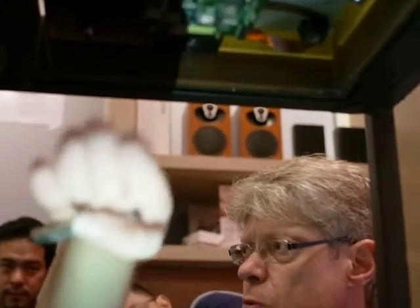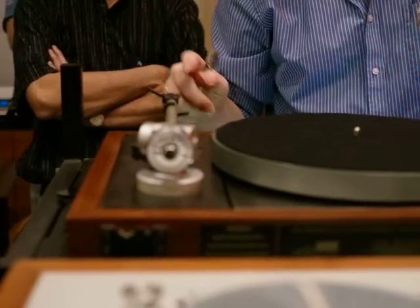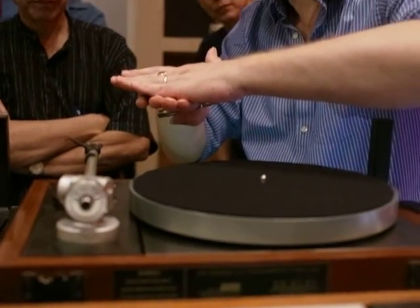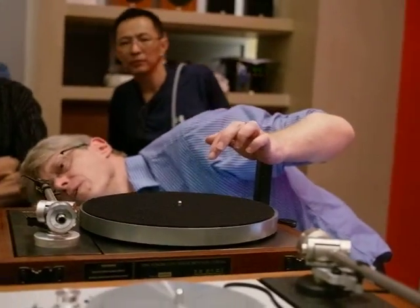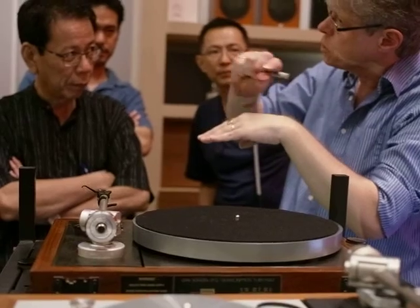And then your suspension, you simply want it to move up and down nice and evenly. Nothing more, nothing less. And to begin with, you need to set the suspension so it's level. So I go right back to the beginning. I put a spirit level here. Sub-chassis is flat. Armboard is fixed to the sub-chassis. So now I can use the edge of this armboard here. I can just look at it, and I want it just above the plinth. Just see the edge of the armboard.